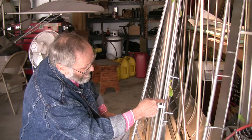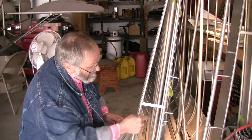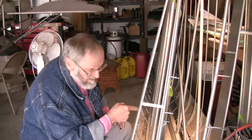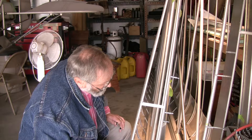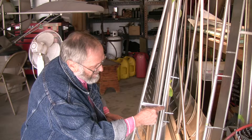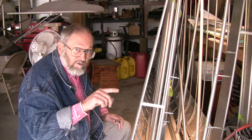I've already drawn a line on the root rib and also a line lined up with those two lines, the top and the bottom. This one is at an angle to match the angle of the rib on top. This one is straight and it's about a quarter of an inch up from the bottom of those pieces. You may have to trim somewhere around an eighth of an inch of excess material off. The idea is to have enough material to drill a hole and drive a rivet into the center of the rib tube, and also to allow the U-channel to actually fit around the curve of the tubing to provide the maximum amount of strength for compression in flight.